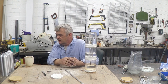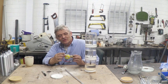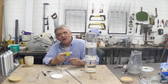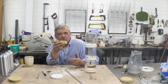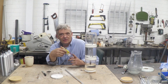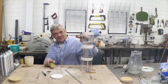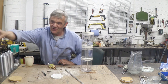The reason I want to create a pressure difference is I've got this thing — this is a little impeller with a generator attached that I bought off Amazon. It's made to go in line with your house supply, so you put that in line with your house supply, when you turn on your tap it will spin the impeller, and it's supposed to generate between 5 and 12 volts. So I want to put that in line here on a bigger version with more pressure.